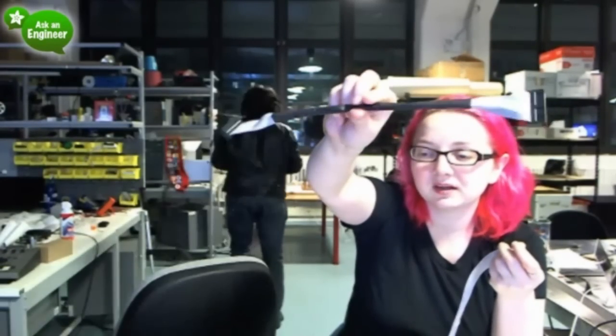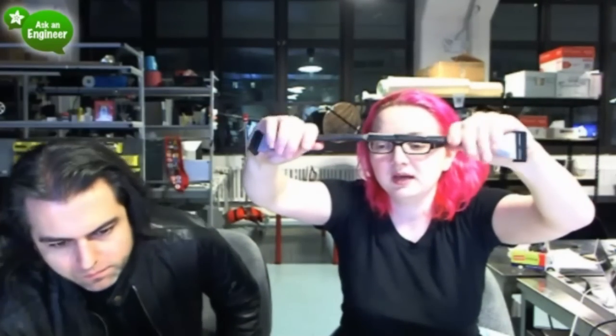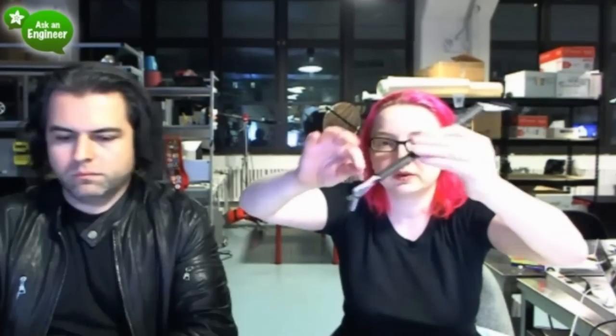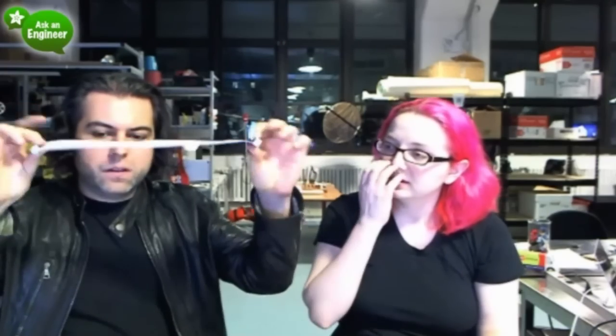The nice thing is it's a lot easier to bend the tube in any direction you want, to twist it and turn it, and to make it go through maybe smaller areas. With normal ribbon cables, they only kind of bend in one direction — it's kind of hard to make it bend in another direction without twisting it. But this one is a lot more flexible because it's been coiled up. A lot of people are doing Raspberry Pi projects and they want to put the cobbler on the other end and have some distance. So this is why we have these custom cables made.